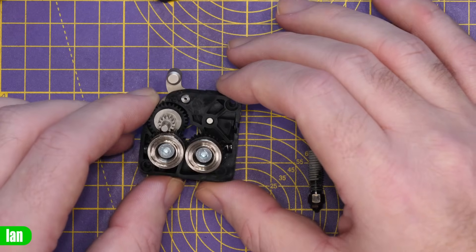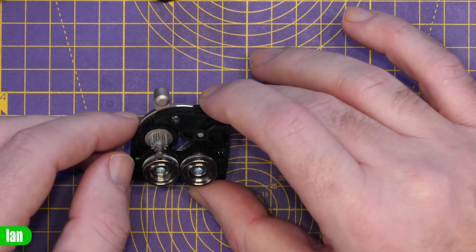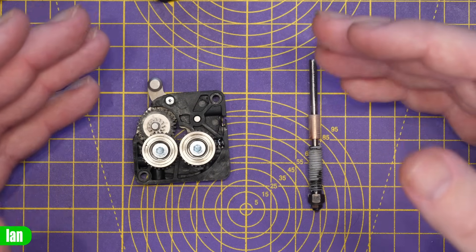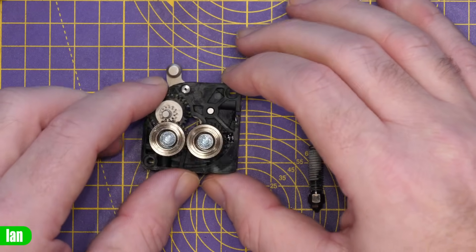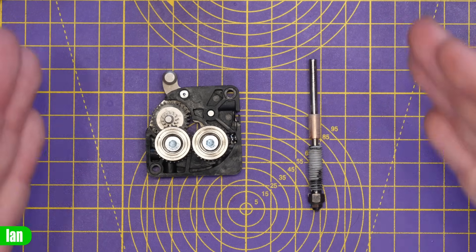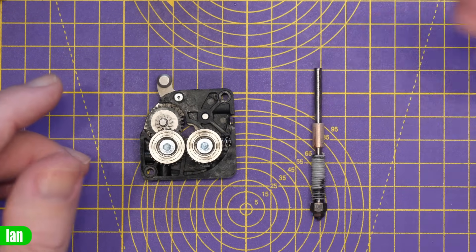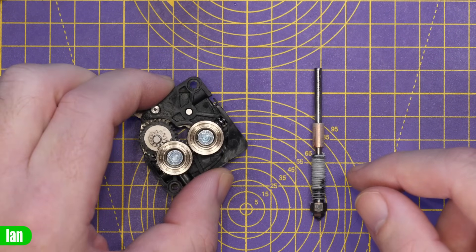Someone asked me if I'm sure it's plastic — yes, I'm sure it's some form of plastic. I've checked it with a knife, given them a scrape on the edge, and they are definitely plastic. There is no metal with these at all. I'm also not saying all-metal is necessarily a good thing — I would have been more than happy if there was one plastic drive wheel with the rest being metal, to give something to shear if there was a physical issue. But this comes down to marketing. The paperwork and website say all-metal extruder. That is not an all-metal extruder. We absolutely have an all-metal hot end with no PTFE and a metal heat break — that is all fine. It's simply what we have going on inside the extruder itself.